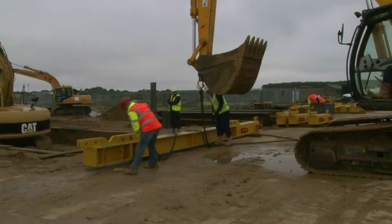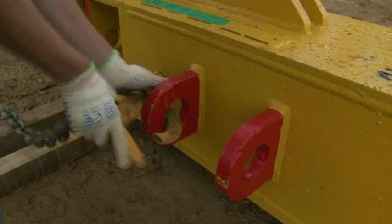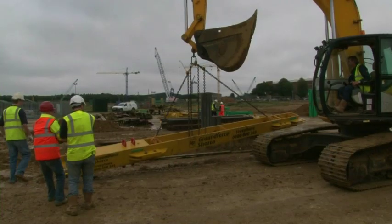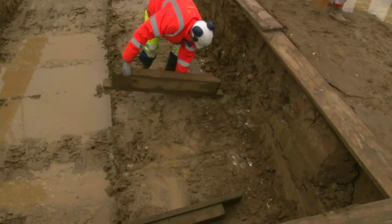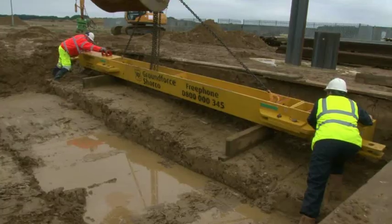The legs must only be lifted at designated lifting points indicated by red paint. Once the leg is fully assembled, it is lifted and placed into its correct orientation on reasonably level timber bearers within the excavation.